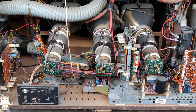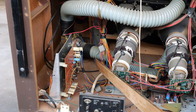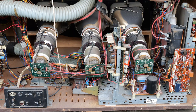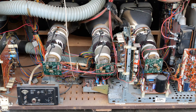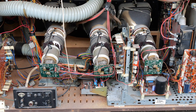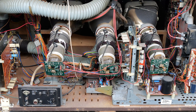This is stepping back in time looking at this. A couple of things that really strike me: the air cooling for the CRT — see the pipe up top? There's another one down the bottom as well. The CRTs in projection televisions have to run quite bright to get an image bright enough to see at the end result; it's got to travel outside the tube, hit the mirror, then bounce up into the frontal lens. Because it runs so bright it runs quite hot, so it needs cooling. More modern units are liquid cooled — the face of the CRTs has a chamber added to cool it. You'd see that in one of my past videos with taking things apart; you can see the fluid inside.